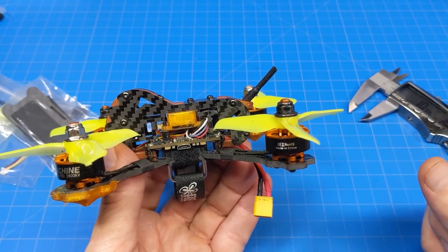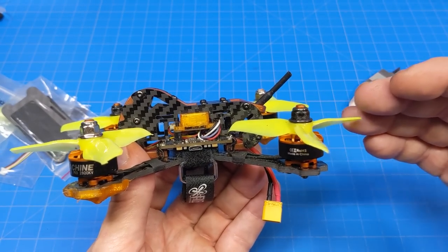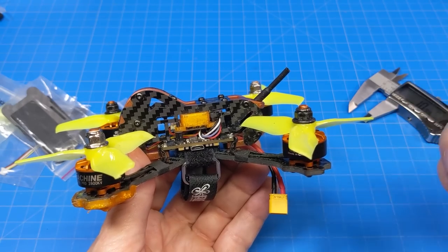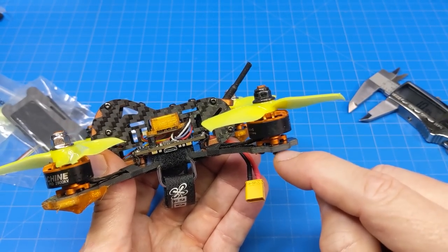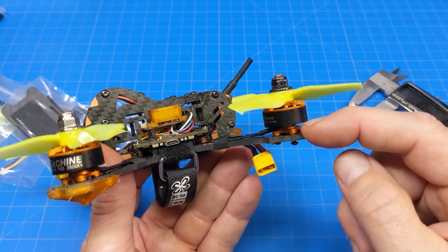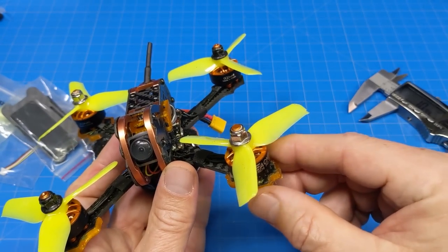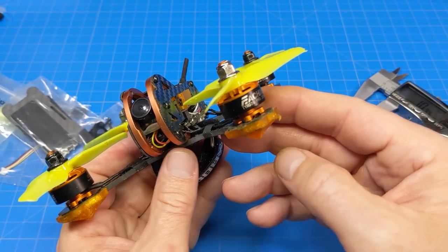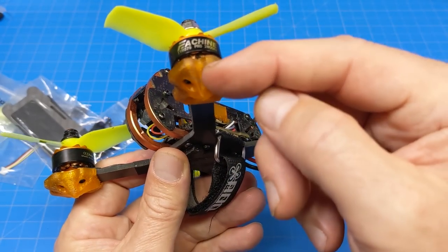That's a little bit unfortunate, but one of the things I get concerned about with all these builds — especially a budget build — is that someone who hasn't done a budget build needs to know some of these little tips. It's not just about which screw goes where; you want to make sure your motor mounting screws don't touch your motor windings up there — that's a bad one that happens a lot when we're new. If I were building this, I wouldn't bother to put these on — they provide a little bit of end-arm protection, but they designed them like skids, and it's a bottom-mounted battery.